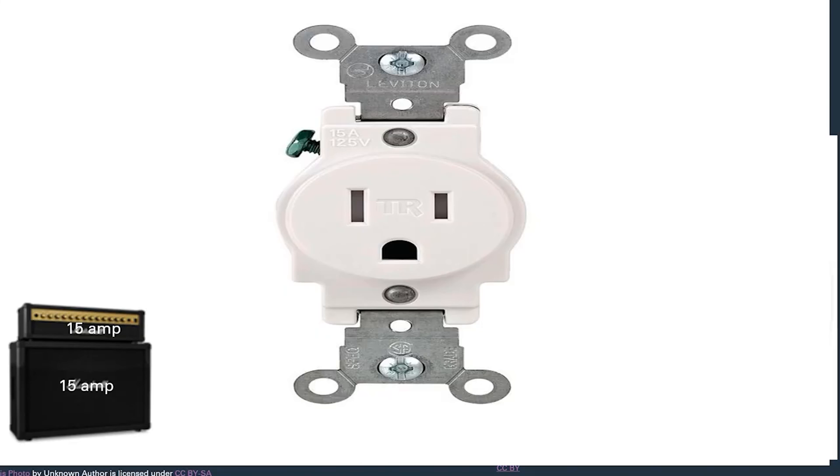This is just something I want you guys to know. You may never use this — I personally don't run 14 gauge wire unless I'm extending an existing circuit — but there's nothing wrong with running it as long as it's protected by a 15 amp breaker and it's 14 gauge wire. I hope you guys have a great day. I am the Electrical Code Coach. Let's go ahead and get to it.